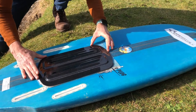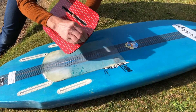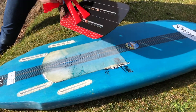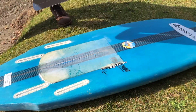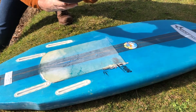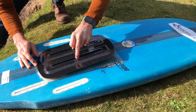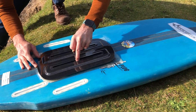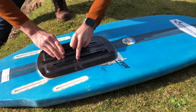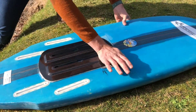So I'm getting a feel of where I'm going to put it visually. I always like to stick the back first. I'm going to take my pre-peeled edges, pull them all off, and line up the back. I'm going to stick the very back portion and then line it up side to side to make sure it's visually straight with the marks I made, using the edge of that skating rink. I grab it from the center, kind of where the inserts are for the T-nuts. So you get it roughly lined up, stick the back — it's down and the front end is still up. You don't want to put it straight down because you'll trap bubbles underneath. We put bubble channels in between the layers of VHB. So I stick that, then turn it a little, get it lined up, and start sticking back to forward to slide all those bubbles out through the bubble channels.